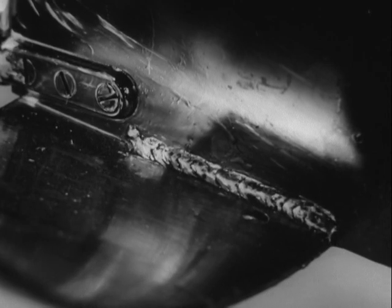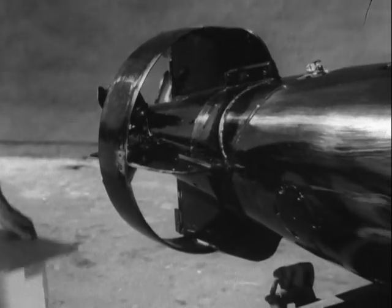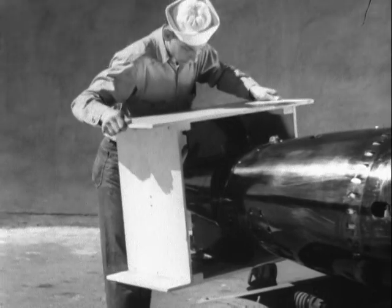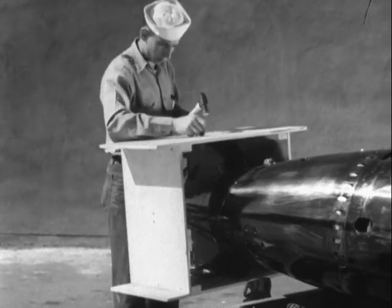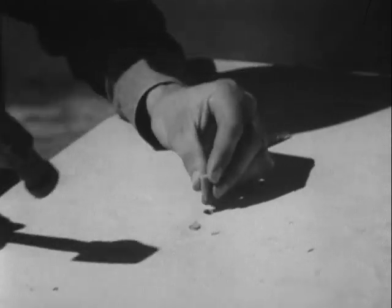This is a steel ring welded to the guide vanes of the new torpedo. Using this ring tail with a nose drag ring and wooden stabilizer, successful test drops have been made at 2,000 feet with a speed of 350 knots. Optimum performance is obtained at about 800 feet and 260 knots.